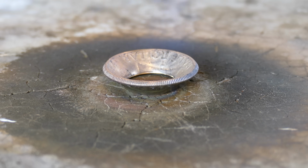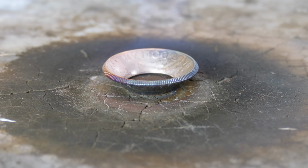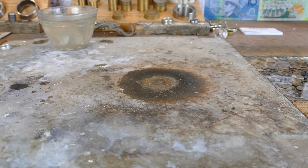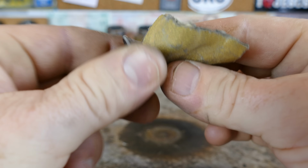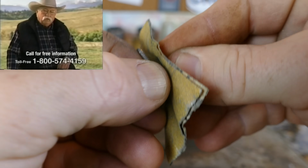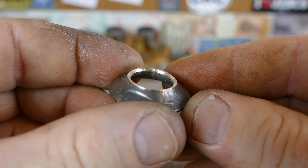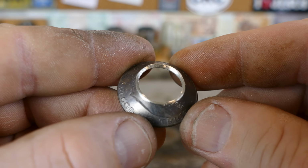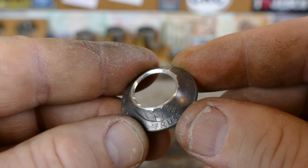And we'll go ahead and re-anneal it now. Every time you move the metal, it's good to re-anneal it because it gets work hardened as we move it. And before we start to bend it again, we're going to re-sand that cut edge and check it for cracks. You check it off and there's no reason not to. And if you find a crack, you can choose to feel sorry for yourself, or you can just go ahead and keep sanding till you get rid of it.